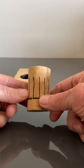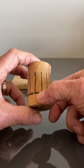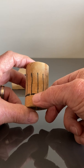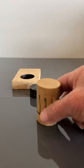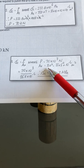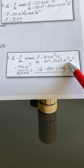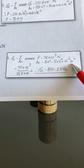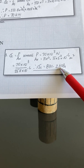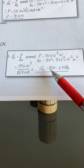We've found that 70 kilonewtons is the force required to punch through a 10 millimetre thick piece of metal with a 10 millimetre diameter punch using a 222.8 megapascal shear strength. Now, once you've found that, if you're applying a 70 kilonewton force — equivalent to about 7 tons — to this punch, you've got to work out whether the compressive stress in the punch will be greater or less than the compressive strength of the punch. If the compressive stress is greater than the strength of the metal, it's going to fail. So you use pi r squared for this circular one, and don't forget to multiply by 10 to the minus 6 if dimensions are in millimetres. The compressive stress in the punch works out to 891.2 megapascals. If the strength of the material from the tables is less than that, the punch will fail.